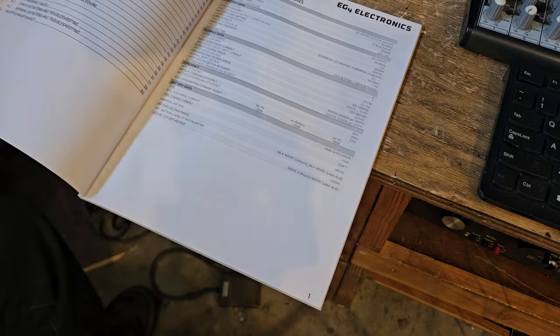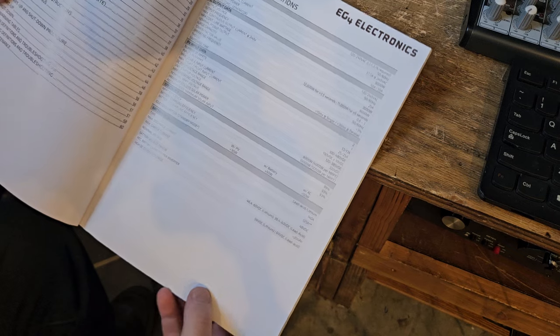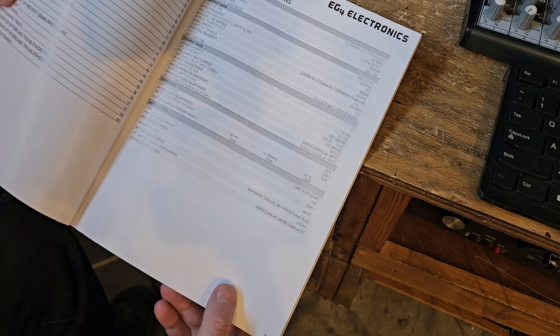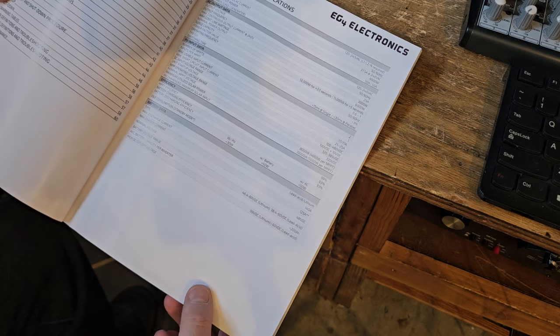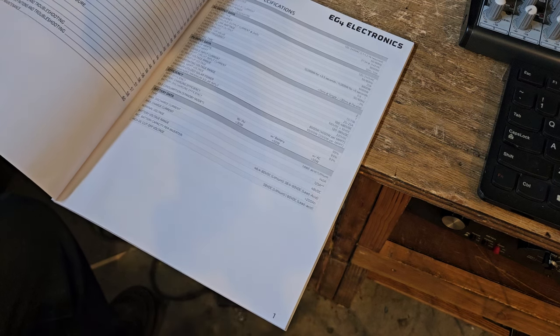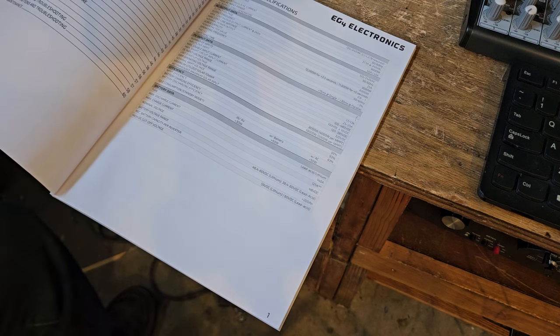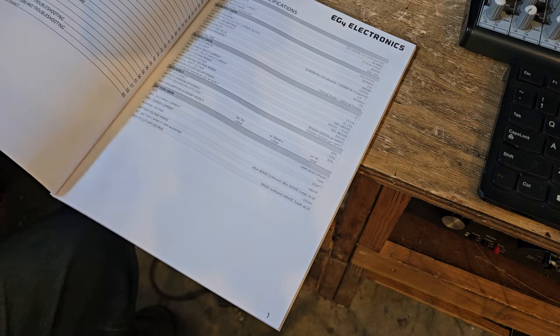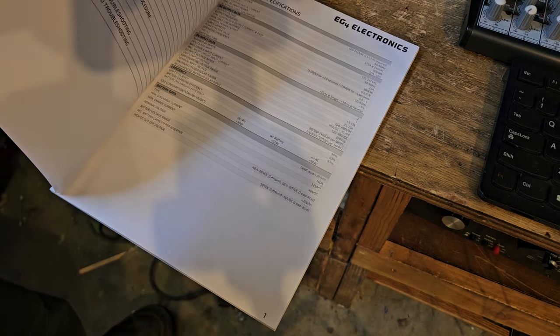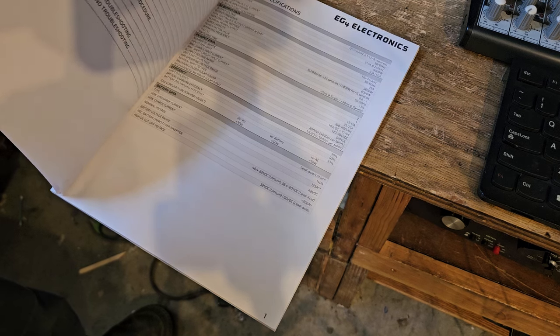Okay. So we're going to go back over here. So basically we need 100 volts or more, so I got to go three panels. I'm probably going to have to go four. So I've got groups of four in a couple of spots, so maybe I'll hook up eight panels to this thing at first. I can probably just string them all together, because if we take 37 volts times 8, let me find my calculator. Well, it'd be like 300 something volts, I think.